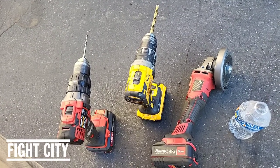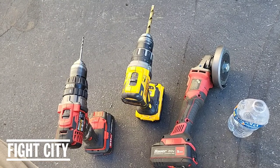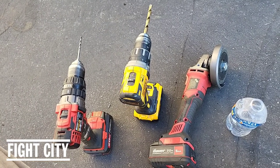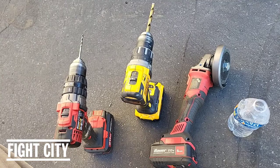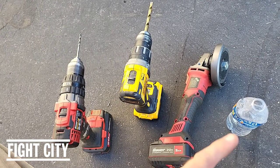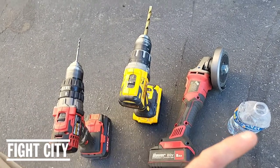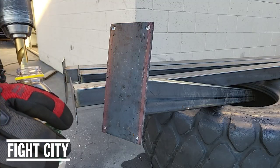This is what I use when I have to drill a lot of metal. I've got to go 32 holes in quarter-inch steel. What you're looking at here is two different drill bit sizes. That way I can do my pilot hole and then my thicker one. I keep water handy so that I can dip my bits in it — that way I keep my bits cold and they keep a sharp edge longer.